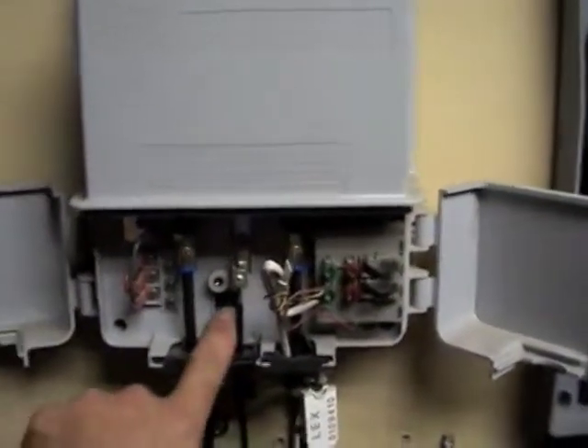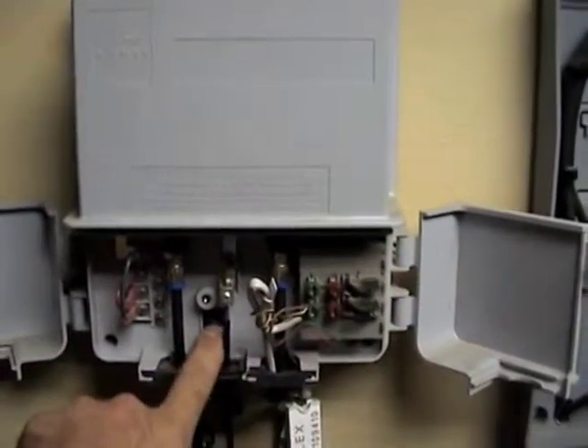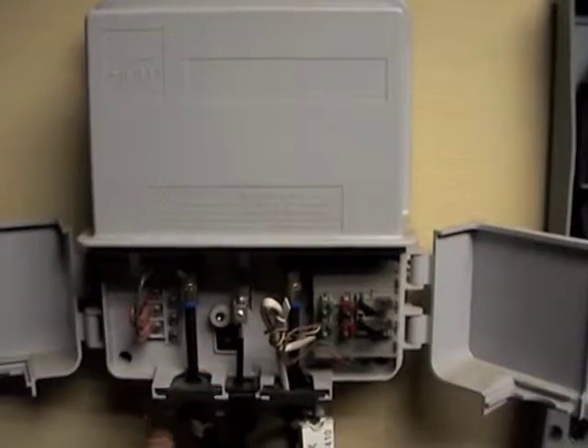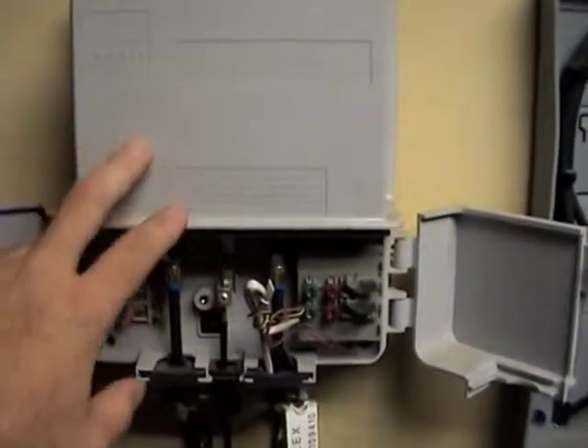If it's active, the light will be on. If it has one blink, that means it has phone service coming out of it. If it has two blinks, there's no phone service coming out of it. If it's three blinks, it's not even synced up to the system. If it's not blinking at all, there's something wrong with the drop — there's no power going through it, this thing is not getting power.